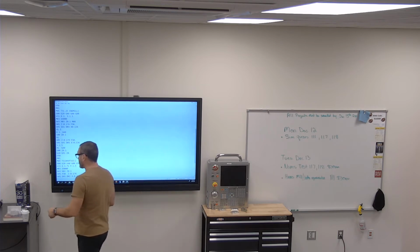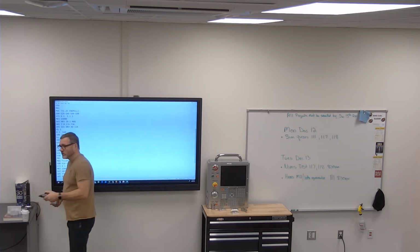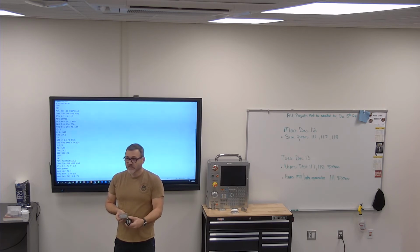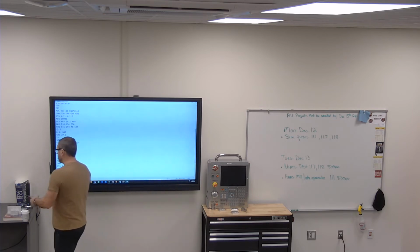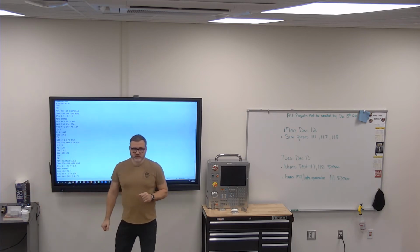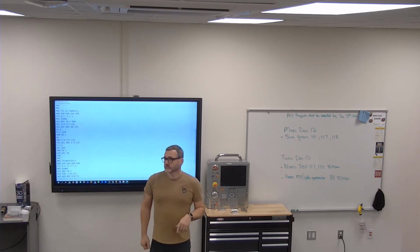But the important thing is that the tool needs to always be on the left-hand side of the part. As the tool's spinning, if you're standing on top of this tool, cutter's on the left-hand side, cutter's on the left-hand side, that's G41. Cutter's on the right-hand side, that's G42. Rarely will we use G42. I haven't seen a G42 yet.